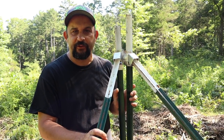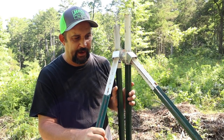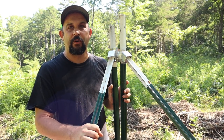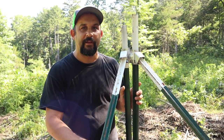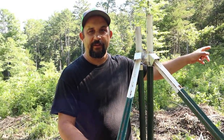These are seven-foot T-posts driven in about a foot and a half, and they're good and strong. So let's go back up by the cow barn. I'm going to show you how to install one of these, and we're also going to install one to hang our gate on today. By the end of the day we'll basically be done with all of the corners and gates on this project and ready to start putting in the regular T-posts along the straight lines.